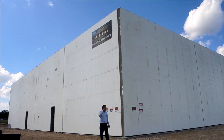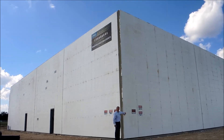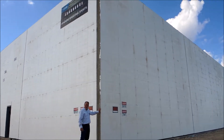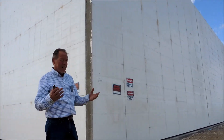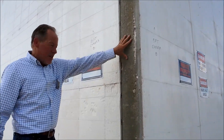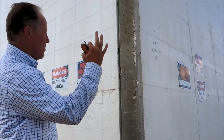The neat aspect of this is these are all ICF walls — but are they? So these walls on the exterior were all produced with the Fox tilt-up product, just like any other tilt-up. But these foam panels were laid down, and then the concrete panel for the tilt-up was poured on top of them, and then they were tilted up into place.